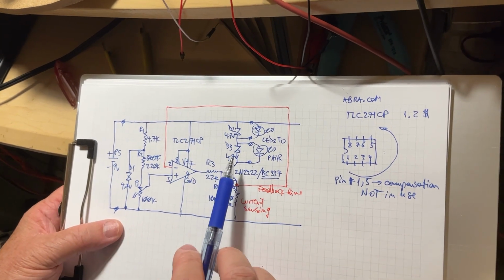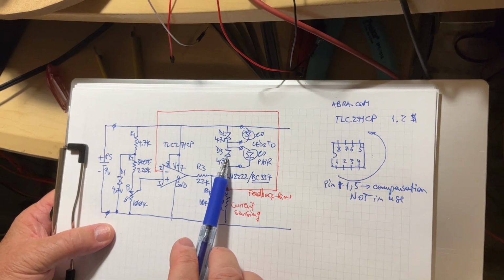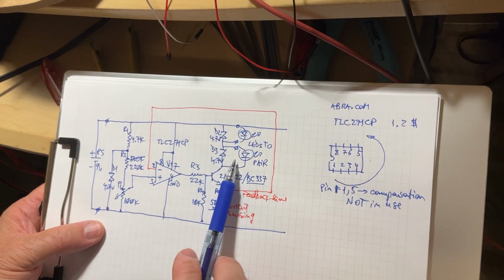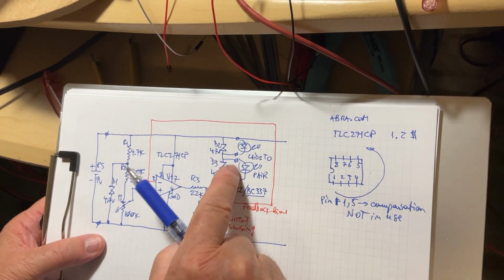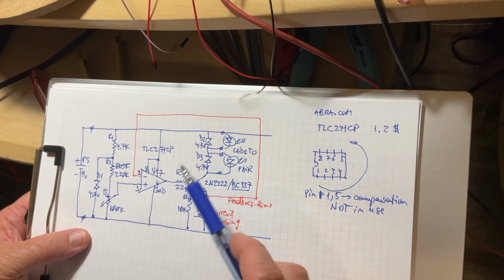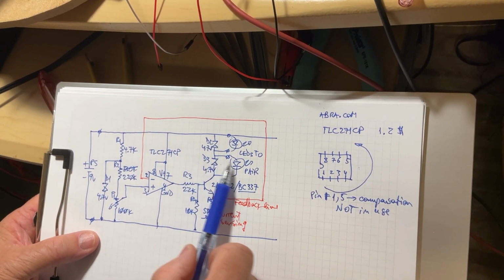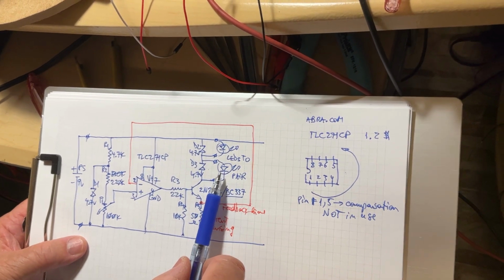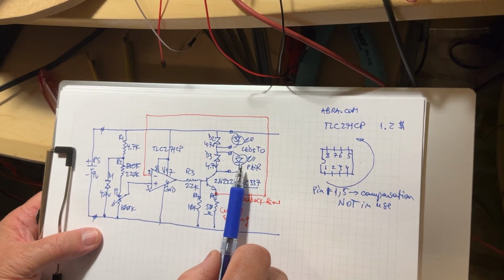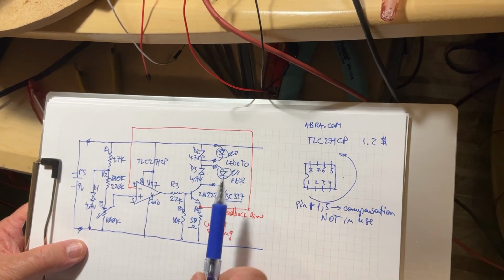Now, what's interesting though is the presence of the two Zener diodes here. They have two purposes. I'm gonna tell you what is the most important: when you connect the LEDs, even if you don't know the polarity of the diodes, if they have equal length for the terminals, if they conduct, everything is fine. But if you connect them the opposite way, then the Zener diode is going to protect the LEDs against burning, because the reverse voltage of the LEDs is usually not higher than 5-6 volts. So by limiting that voltage to 4.7, the LEDs are going to remain safe.